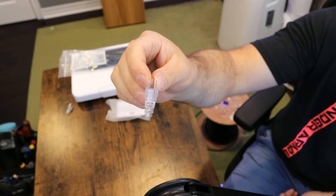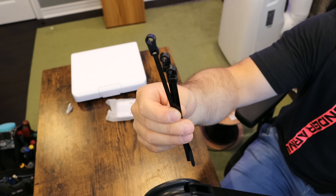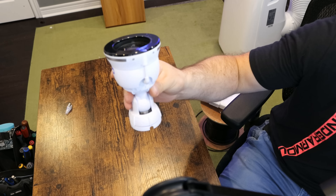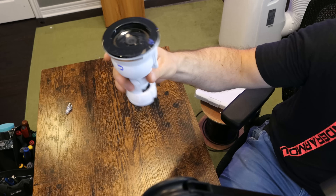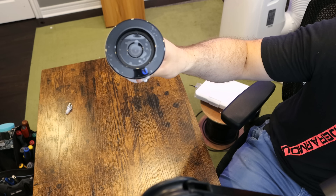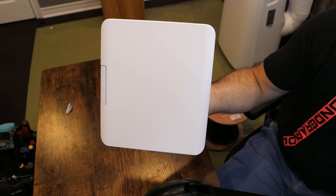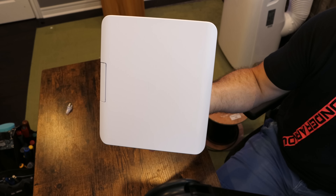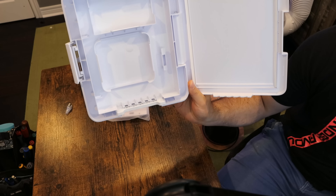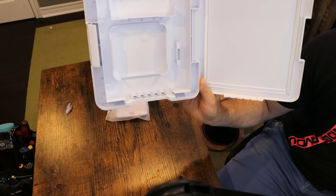I always like to put these clear boots on my RJ45 ends. We have some cable mounting ties, which really come in handy — I don't have any cable clips right now so we'll just use these. And we have our G4 Bullet camera, which has the IR extender on it. I'll do another video on the IR extender and how much it actually improves the night vision. And what we'll be using to mount the switch into is the UniFi USW Flex Utility Box. This thing is kind of big and might look ugly on my fence, but at least it will keep the switch protected. So now let's go get the cable run done.